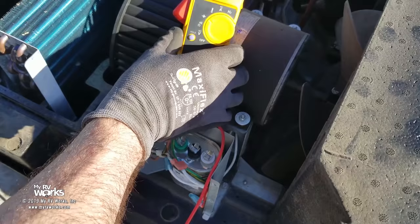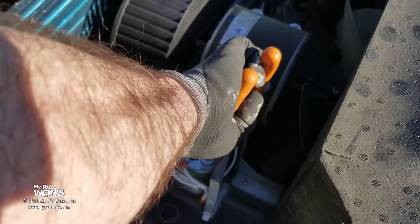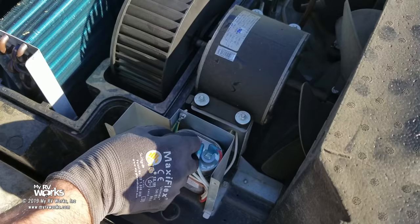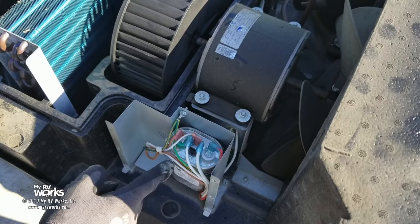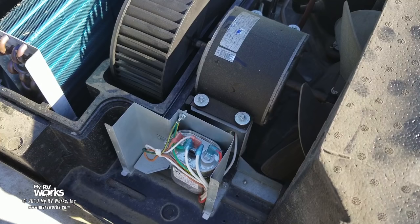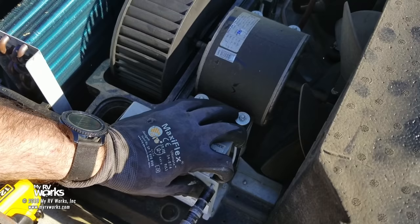There's nothing wrong with that capacitor, nothing wrong with our compressor, and I do not see any leaks or oily residue. Some of you might have two or three capacitors — you might need to take the nut off to read the microfarad rating. Get that information, put your meter in capacitor mode, and check it. If it does not read what it's supposed to read, you have a bad capacitor. They're about 20 bucks — not a big deal. If you do replace your capacitor, make sure you get one with the same rating. The next part of our journey is going to take us to the control board.